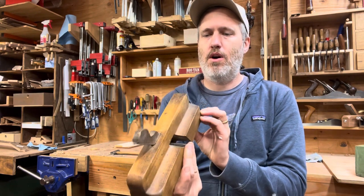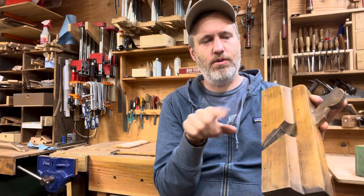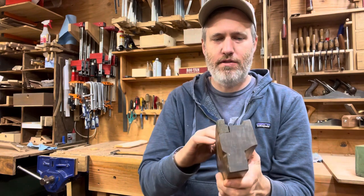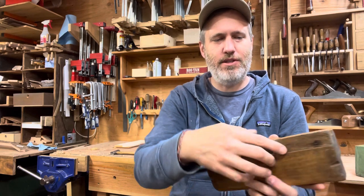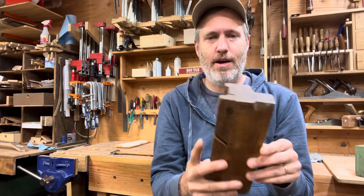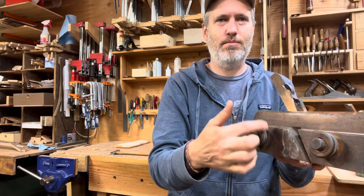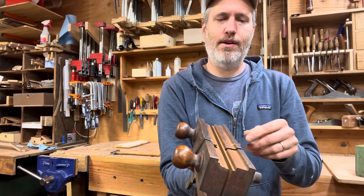We have a couple that are in poor shape and I'm not totally sure what's going on. This one says Auburn Tool Company, and I believe it used to be a complex molding plane, or just a hollow or a round. But this bed is a really weird shape — a gross shape — and it's very crudely hacked out. The blade is rusty and kind of ruined, also hacked to a similar profile. And the fence has been replaced with just a piece of pine nailed on. So I'm not sure what this plane was supposed to be, but it has been user-modified to the point where I'm not sure what can be done with it. Another one that needs repair is this kind of complicated one that has these cool wooden screws — basically wooden nuts and bolts somebody made — in order to change its width. And this used to have two irons in it; it only has one iron and two wedges.